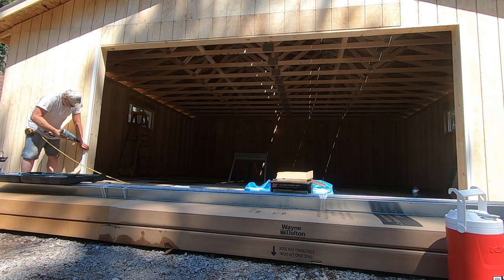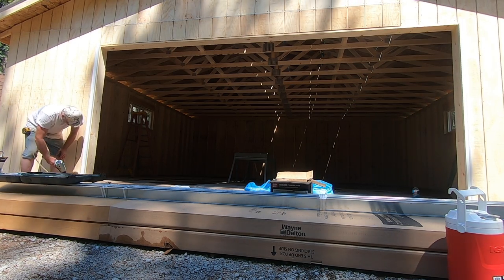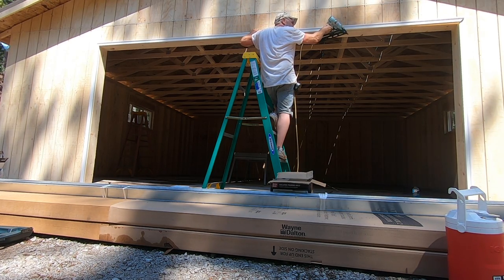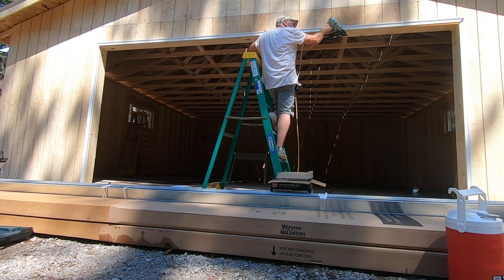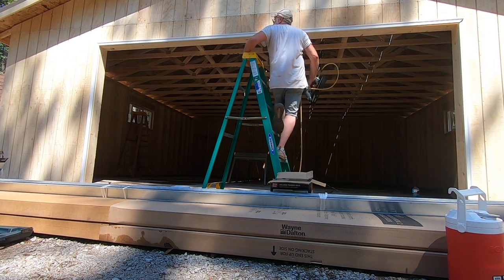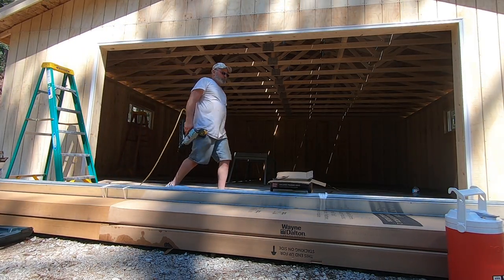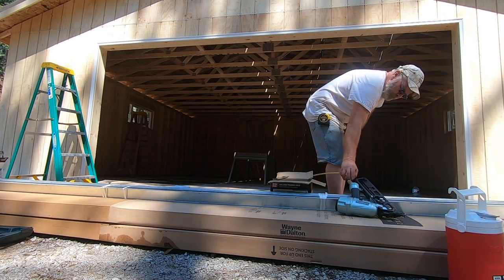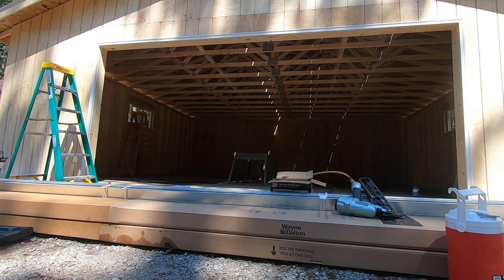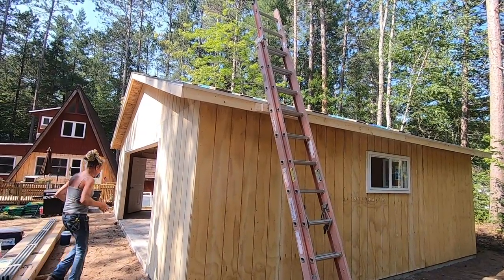So as Willow finishes papering the roof, I go ahead and put all the brick mold around the windows and the overhead door. After the brick mold is on, I go back with a skill saw and cut a raglet above it, and then I place a piece of flashing in and then caulk it. It's about the only way we can really comply with the flashing code on these T111 buildings. And the roof is loaded, leaving us with just soffit, shingling, and the overhead.